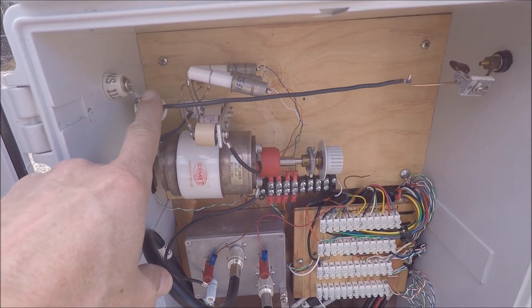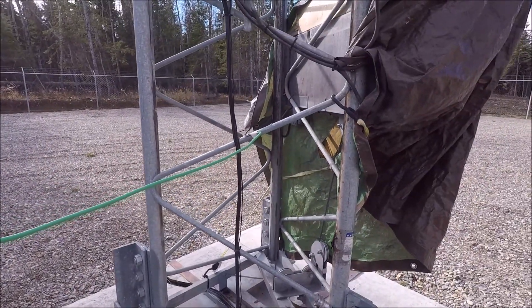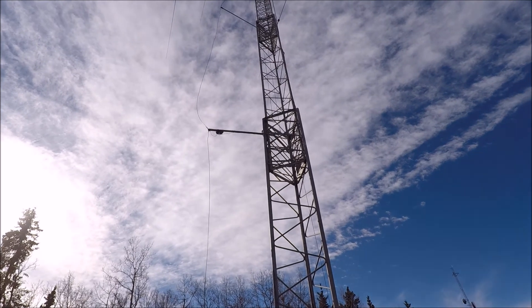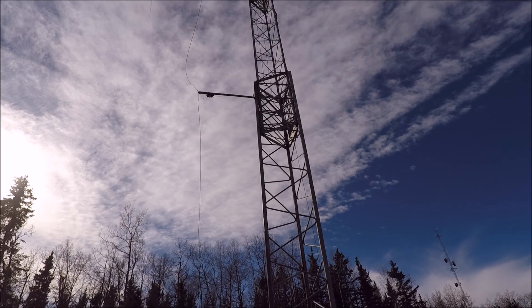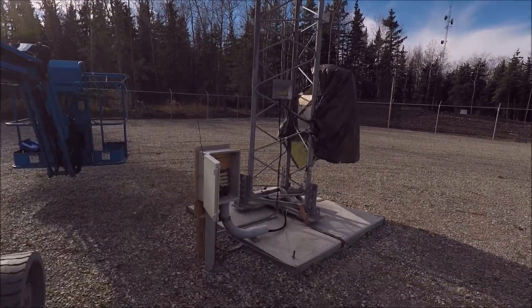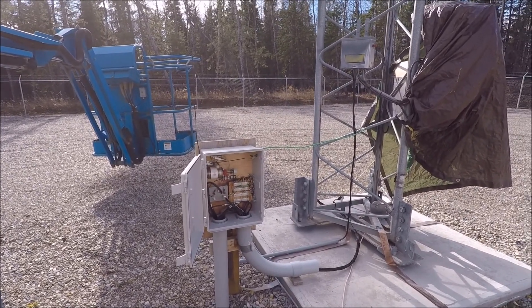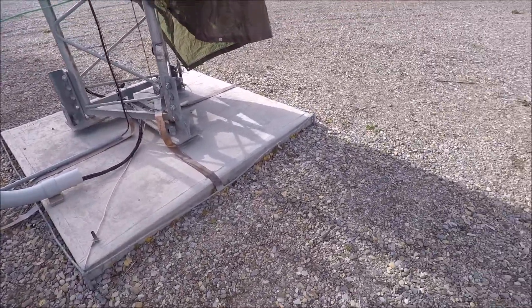The single pole double throw relay is toggled in when I'm on receive, and then it goes along through a tuning capacitor here which is then grounded to the lower section — the bottom of the section. There's also a relay box part way up on that bottom arm, and in that relay box during receive, it opens up and makes a closed loop on this bottom section. That bottom section is tuned for maximum current, which basically detunes the tower and provides for eliminating or minimizing any detuning effect on my receive arrays.